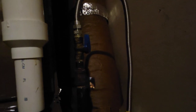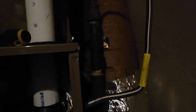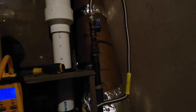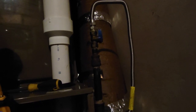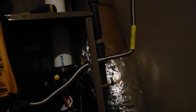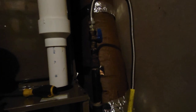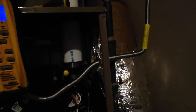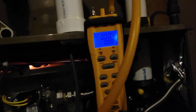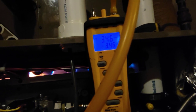Another thing I want to mention is this gas line right here — you can see it's three-quarter, then it goes to half inch, has a shutoff, and then a flex hose. Sometimes the flex hose will produce a pressure drop. I've also had a situation where the velocity going through that pipe going to that flex hose will cause a whistling noise. I've had to replace that flex hose with a larger size so that you don't have that whistle or that sound.